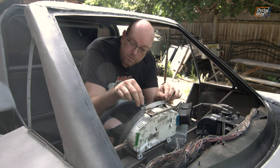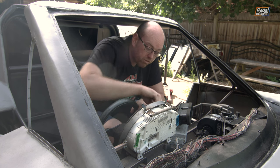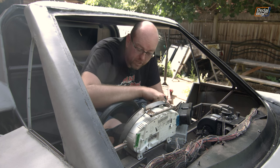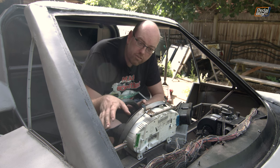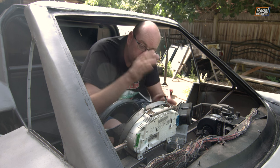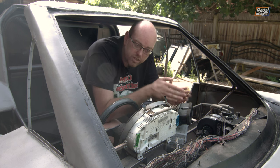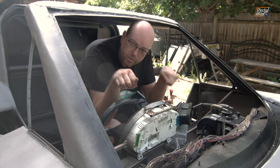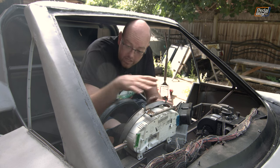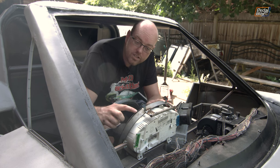To make use of the clips at the top as they would be on the normal car, I've just run some inch box section and spent some time at the vice bending it into shape. I could have used the ring roller, but I think this material is a little bit too thick and wide to effectively work — it would have had potentially a bit of a twist where the whole bar wasn't supported. So I just used it in the vice, tweaking it back and forth, and I've got a really nice curve that matches up nicely to the inside or outside of the clock faces.